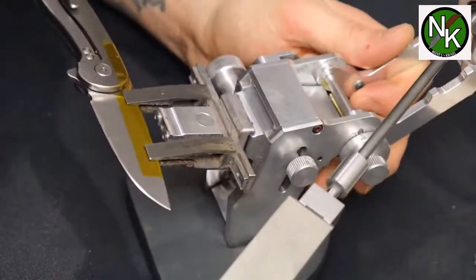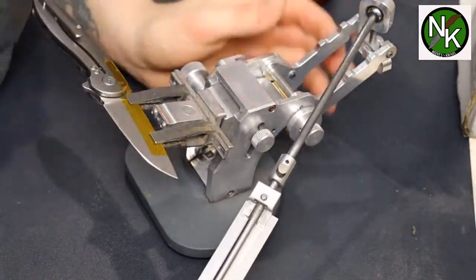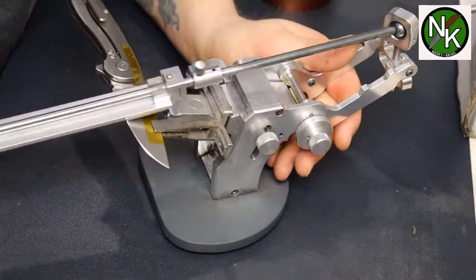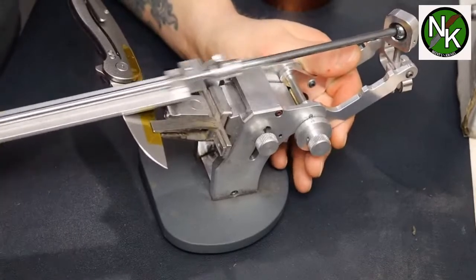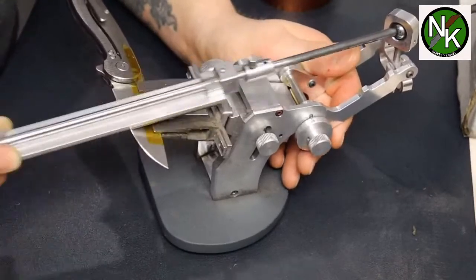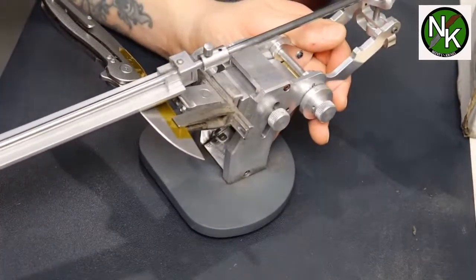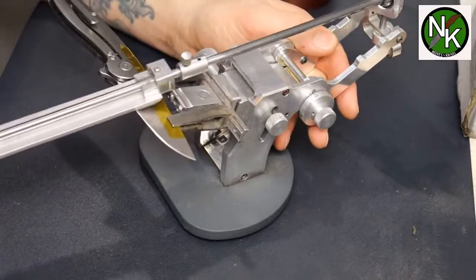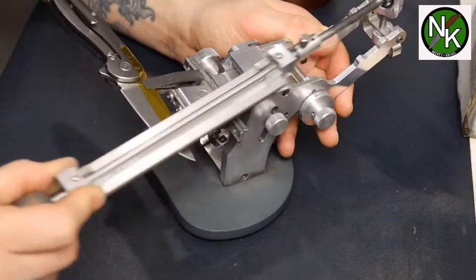But all right, so now I switched to my extra coarse F-150, which is like 300-400 grit. So anytime you work one spot, like, say if I'm working right here, I have to blend that. If I work up here like this, I have to blend it. So anytime I work one area, I have to do complete passes.